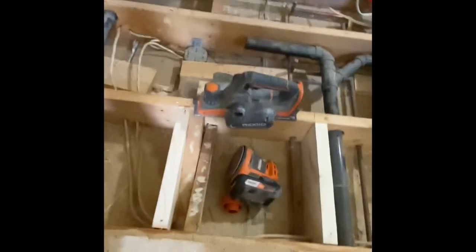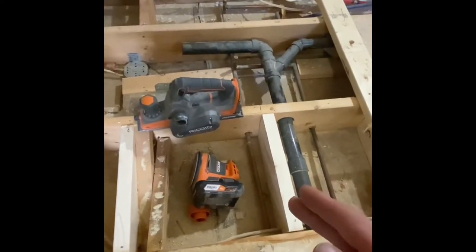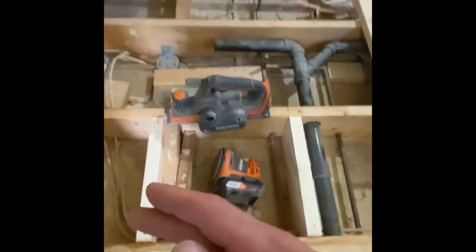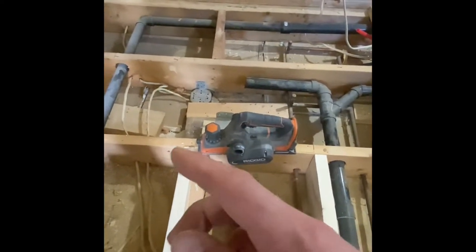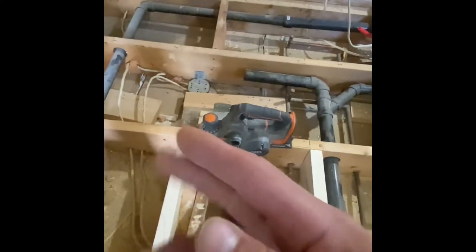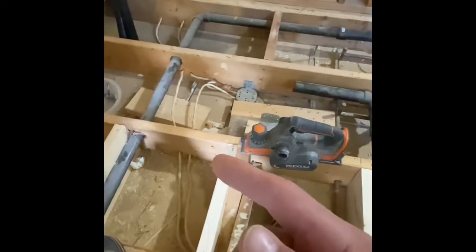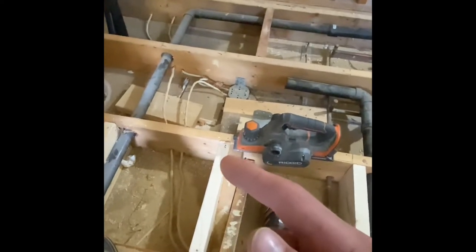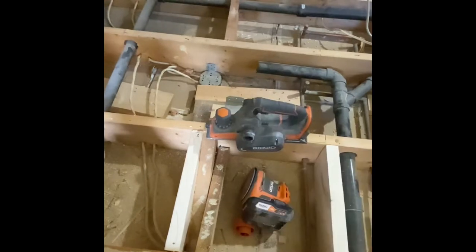What I'm doing right now is hitting the tops of these with my planer and sander. These ones are just a little — I'd say maybe between an 8th and 16th — higher than the old lumber. Just over time, this has been in here about 30 years or so, so it's just a little high. I don't like it, so I'll hit it with the planer and then take the rest with the sander to give it a nice smooth transition.